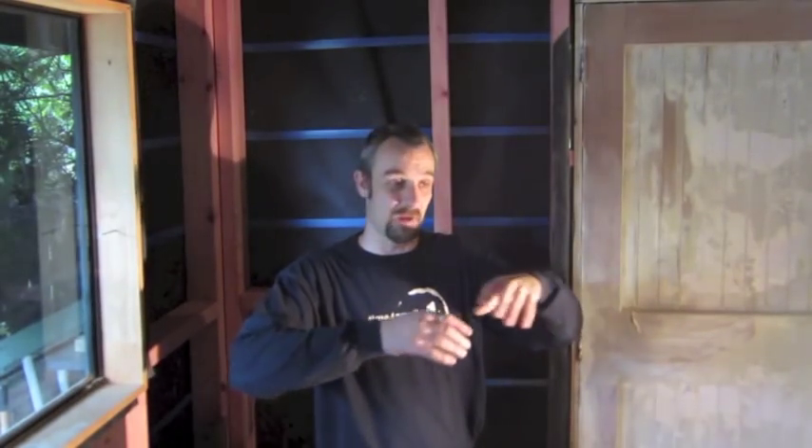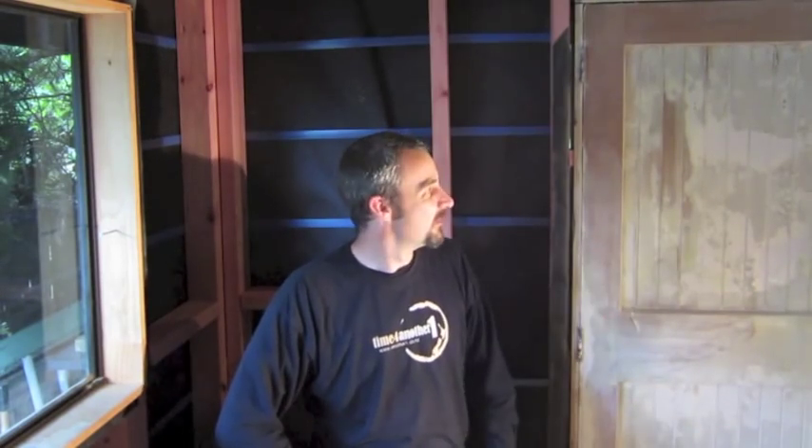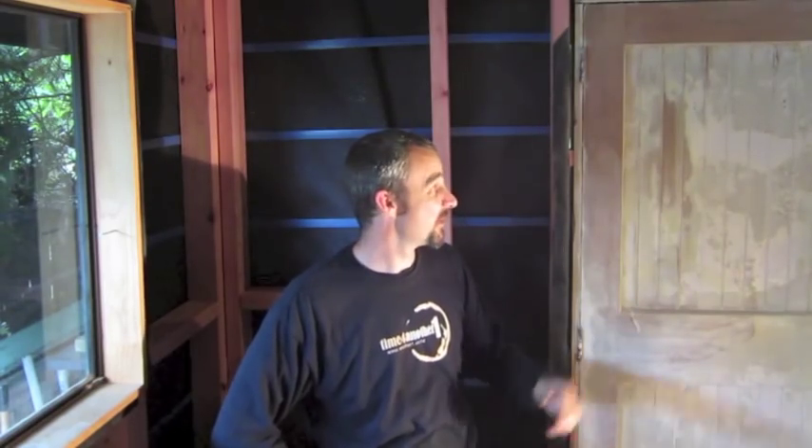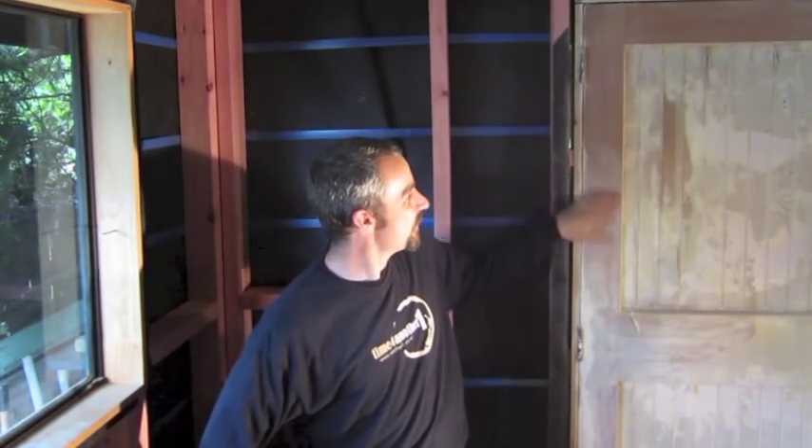The flat was up above a shop at the end of town where all the pubs were — it was great. It had a high stud and all this woodwork, all painted. I said to the landlord, look, I can strip that paint off, and if we don't have to pay rent for a week or so, he said go for it — tidy it up, make it look nice. So I started stripping it with paint stripper. Damn, I should have remembered — it's bloody hard work. Paint stripper doesn't take all the paint off instantly; it takes the first layer, and the second layer is sucked into the wood. You've got to scrub it and get that scrubbed-in paint stripper out. Best thing to do is dip stripping — take the whole door to a place, they dip it in a pool of acid, take it out and it's all clean. But we'll keep working on it because it's a very nice-looking rimu door, and hopefully it's going to come up really nicely.